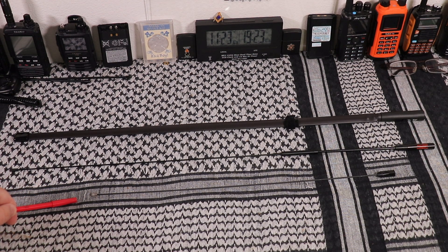The first antenna we're going to be looking at is the Signal Stick made by Signal Stuff. Per the website these antennas are handmade, ultralight, and nearly indestructible. You can buy these in a 2 meter/440 antenna, 440 only, or 220 only, in BNC, SMA female, and SMA male. The frequency range on the dual band version is a quarter wave on 2 meters and three-quarter wave on 70 centimeters. The SWR has been measured as low as 1.3:1 at 146 MHz and 1.5:1 at 440 MHz. The dual band is approximately 19 inches long. It's made of nitinol, a very resilient and ridiculously flexible nickel-titanium alloy. They are made in the U.S. in Utah and come with a lifetime guarantee. They come in a wide range of colors and you can even get one that glows in the dark. At the time of this video they're going for $20 a piece.